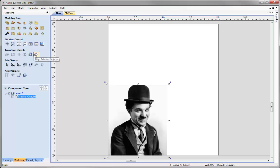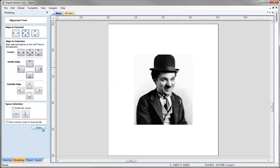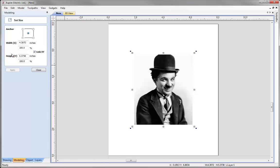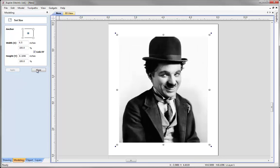You can also use this tool here and just click this button. Once we've got it centered I'm just going to resize this image — I want to make it so it's 8 inches tall and 6 inches wide, which will leave us with a nice 1 inch border around the whole of our material. So I'm going to go over to the set selected object size and change the height. I'll keep it in the aspect ratio and specify a width of 6 inches. But 6 inches is not going to quite meet the height of 8 inches when resized in proportion, so I'll extend the width to maybe 6 and a half inches so it brings the height to just over 8 inches. Then we can create a rectangle that sits around our image to use as a boundary to machine in between when creating our toolpaths. I'm just going to click apply and then close this form.